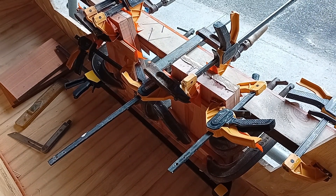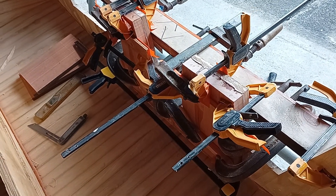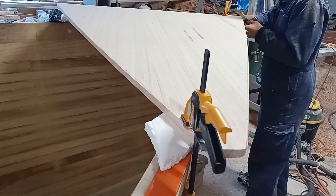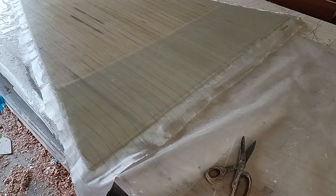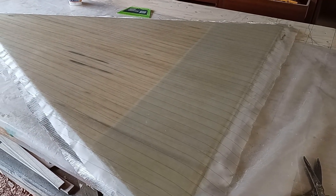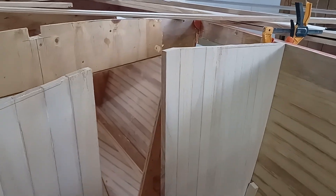While I'm waiting for the glue to go off on the bulkhead I'm making for station 1.5, I'm doing some work on this area which I'll need to do before building the cockpit — some final fitting on the anchor locker floor before glassing. One layer of 400 gram uni underneath, two layers of 400 gram biaxial. This is bulkhead 1.5 and it's pretty close to being ready to come out and glassed.